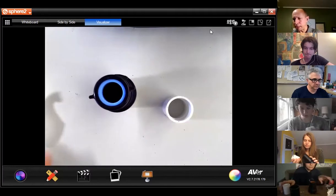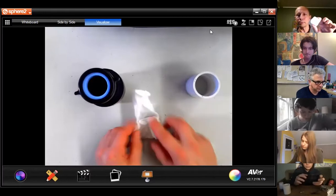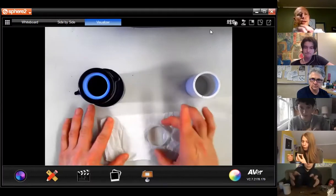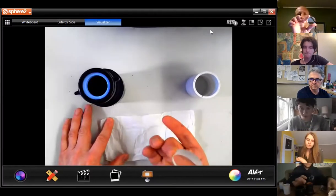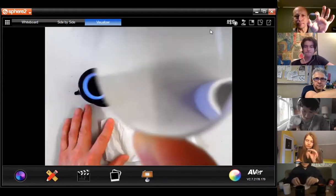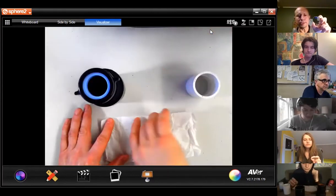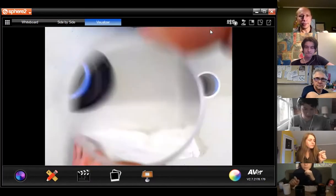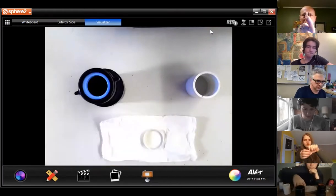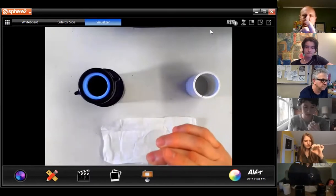If you reach down in your bag, you'll find, probably wrapped in tissue, possibly wrapped in bubble wrap, your lens. Go ahead and open it up and handle it by the edges. Don't grab the surfaces, so you don't get fingerprints all over it. Keep your optics clean. In fact, in optics factories, they will never touch optics with their bare hands, always with rubber gloves on. Hold it edgewise, and you'll see that one side looks kind of flat, one side looks kind of curved.